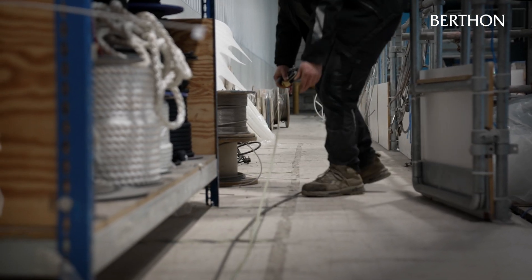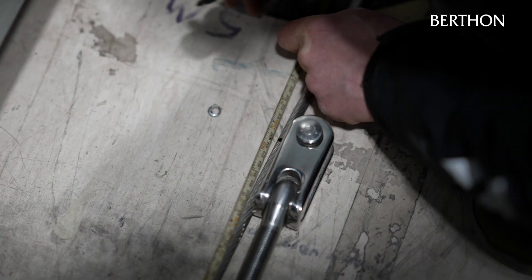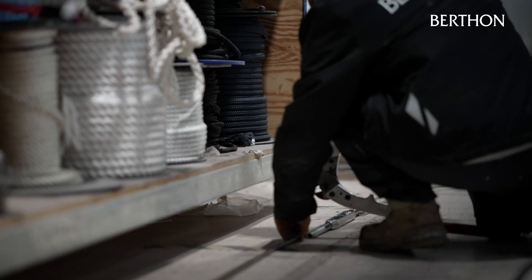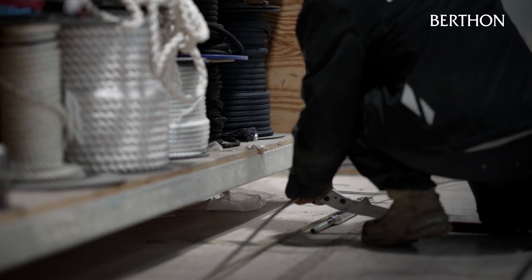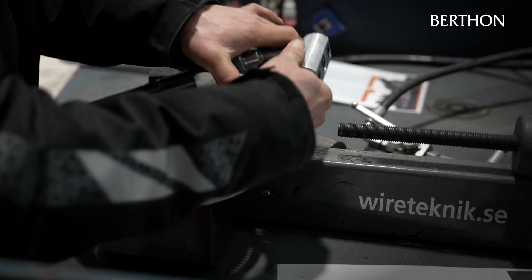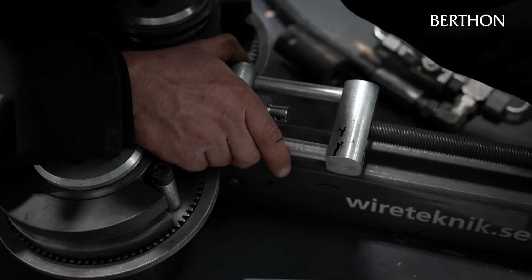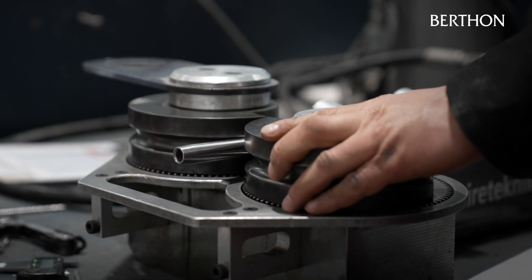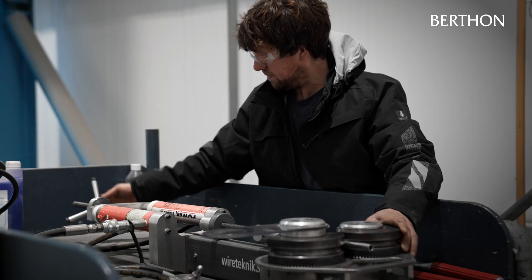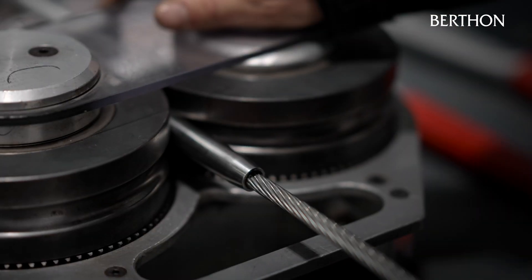We preset the rigging screw to two-thirds or half open depending on the circumstance. Two-thirds open allows you to bring the mast back down tight. When copying old rigging, the new rigging screw is usually set between half and two-thirds open to allow room to tension and adjust. If the old rigging comes in bottomed out, we lie the new next to the old, but with the new rigging screw at two-thirds open allowing for scope — so we can set the new one to the same length but with enough adjustment.